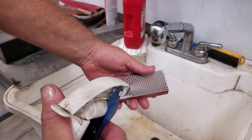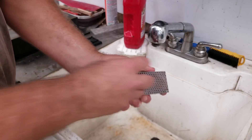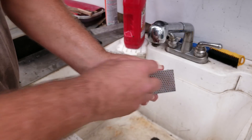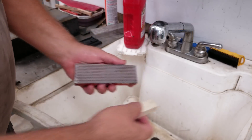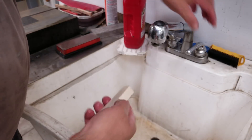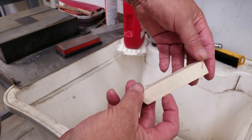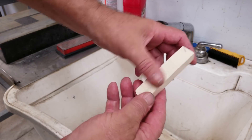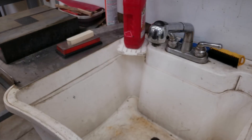You can repeat if you want, but there's our stone on all four sides. This keeps your stones reasonably flat and nice and clean. You can go over all four sides one more time — it doesn't do you any good to be heavy-handed with this, just a real light touch is all you need. After you get your stones nice and flat and clean, it's no big deal to keep them that way — just a quick rinse and that stone's ready for next time. It's not impregnated with oil and junk off the mag and little bits of cast iron or whatever you've been stoning. That's how you keep your work stones clean and ready for use and functioning really well. All right guys, that's all I got — thanks for watching.